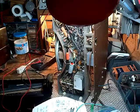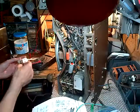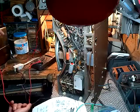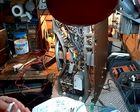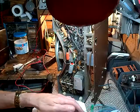I think we should operate this and see what effect that's had. I've operated it before putting in this capacitor and it's just a non-stop hum — no reception at all. Maybe because of other reasons, could just simply be because of lack of antenna. But last time around all I got was pretty ugly hum.